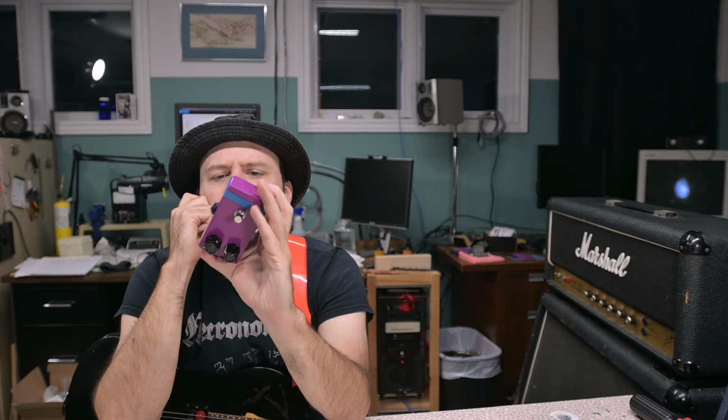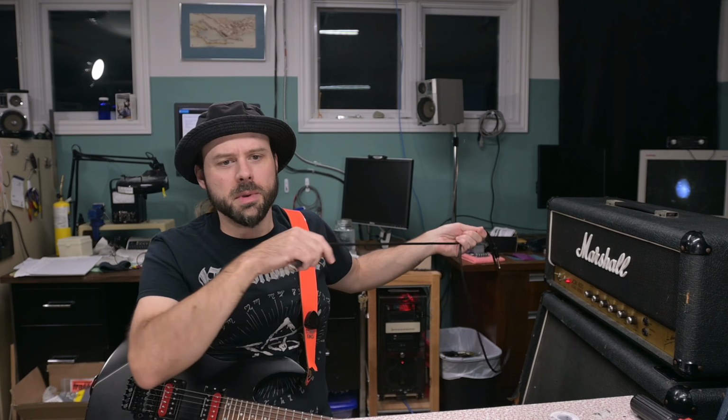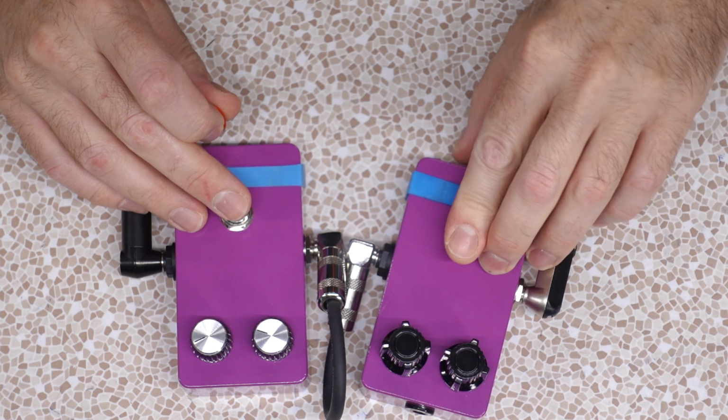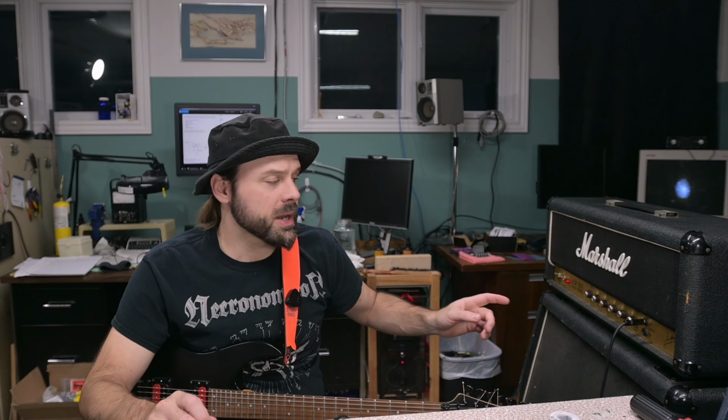Okay, cooperate. The batteries are roughly the same voltage. We're instituting some margins of error already. Of course, there could be margin of error variances between the transistors, especially germanium PNPs. Germaniums aren't known to have the best quality control. And I don't know, just certain variations. But, well, let's find out. All right, same value input capacitor.